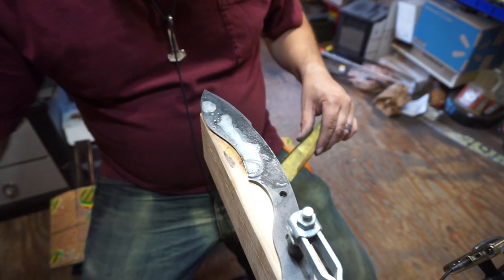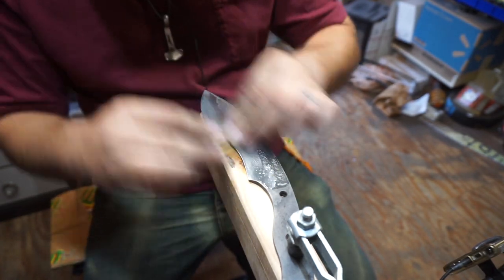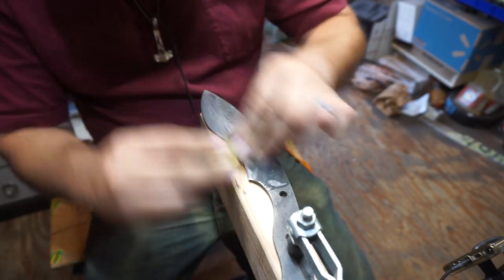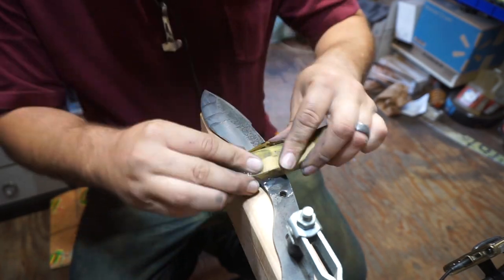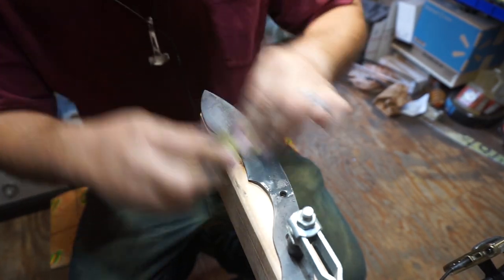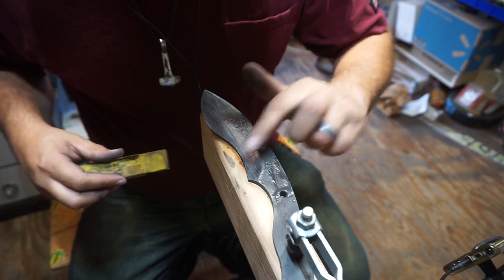And what I'm going to be using on here is a sanding block that is hard foam on one side, soft foam on the other. This comes in a bigger block that I cut down, but I'm using the firmer of the foam. So it's not me using a metal rod, because with how much curve and how I change the bevels on this, you can't use a solid, hard backer on it. You've got to use something that has a little bit of flex to it. But there's a portion of the 3 hours of sanding that I did.